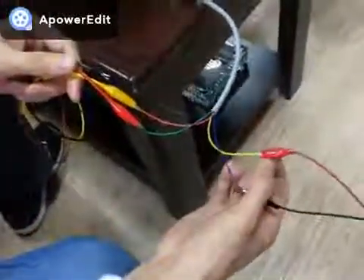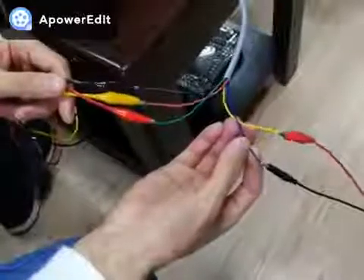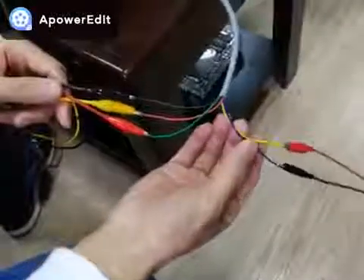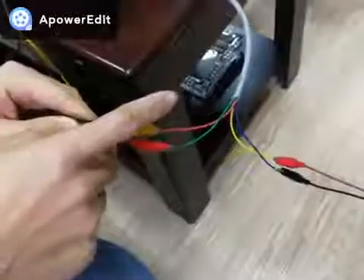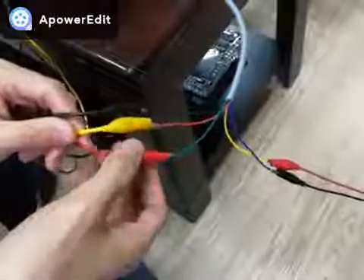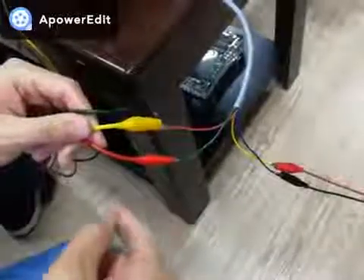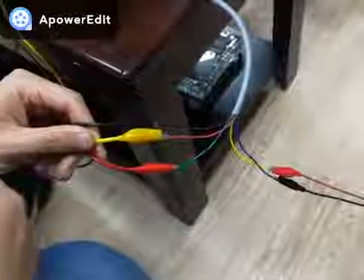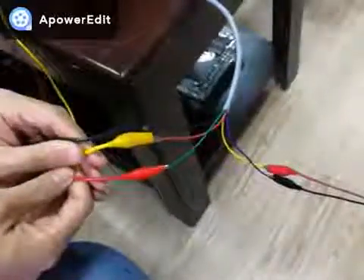Let's see how the valve is wired to the generator. The valve has 5 wires: 2 are for power supply, which can be DC 24V or DC 12V. For the other three, the black one is for the common end of the generator, the red one is for inputting signal to the valve, and the remaining wire is for receiving the feedback signal from the valve back to the generator. So the valve can not only receive a signal to open or close, but also output a signal for real-time monitoring of the valve position.